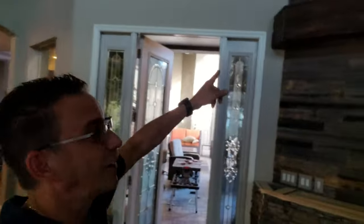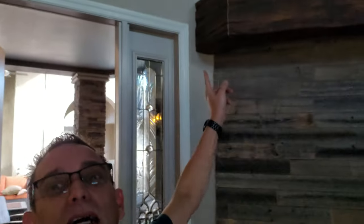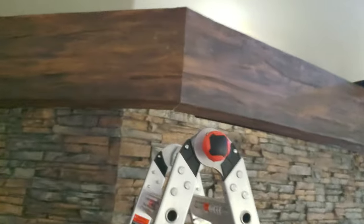We got this all done, the second beam up above the fireplace. That was similar with this 45 angle cut right here. I did have to use some shims on that one, but we got it in and it looks really clean there. That angle's really clean. Not much spacing in between there. That'll make the touch-up patch work a lot easier. This one, I fine-tuned last night, so that even looks better now. If you can see that.